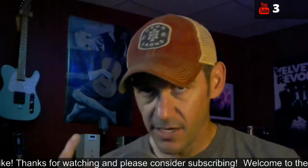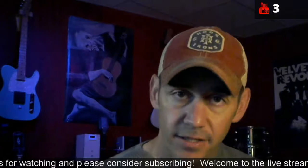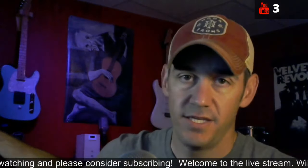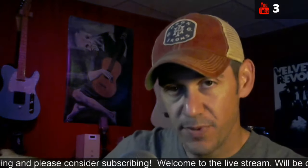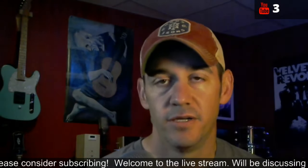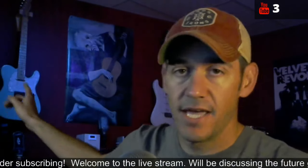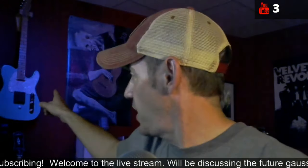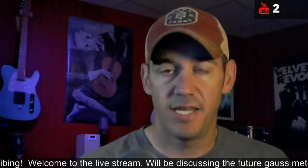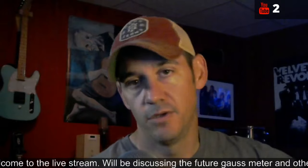Now, one thing I would say do is that when you're making your Telecaster body, when you route out the spot for the bridge pickup, go ahead and make it the size of a humbucker so you can change it out to that one day, because they sell those bridges that have the humbucker spot for it, where you can just basically change it out. And if you wanted to build a humbucker, you wouldn't have to get another guitar.